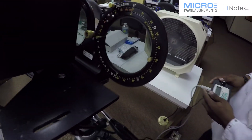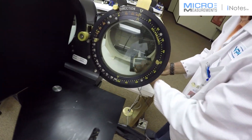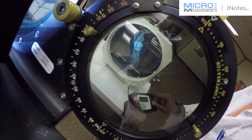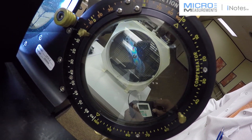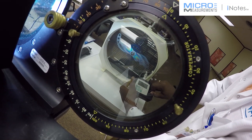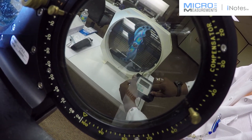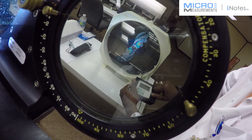To do so, I'm simply going to turn on the stroboscopic light source and use this device here to capture the rotational speed in RPMs. Currently we're showing about 3200 RPMs. With a few adjustments, I should be able to get it to slow down and almost look like a static analysis. Simple adjustments to the rotational speed will allow us to do so.